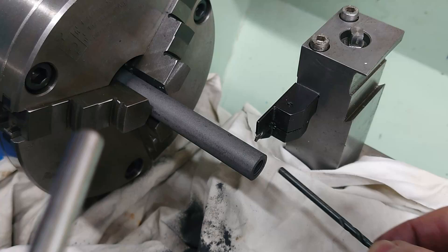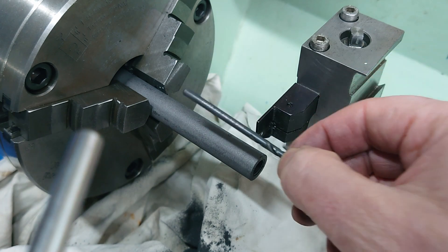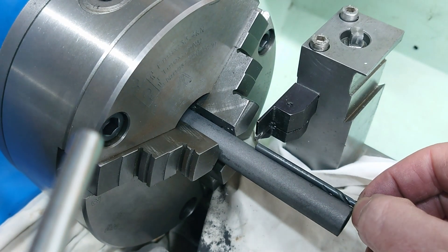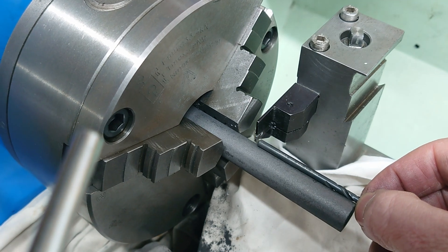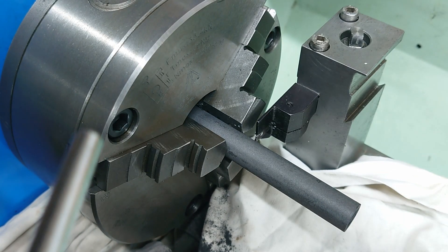Alright, let's part it off. I'm just going to put this drill bit in, get the depth so that hole is that deep, and I'm just going to eyeball it and say we want an extra 5mm on the end. It doesn't matter if it's a bit thick — it's probably good. You can always turn the excess off; it's a bit hard to add it back on again.